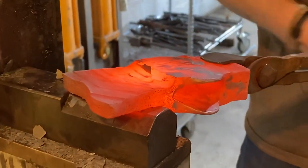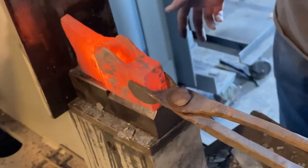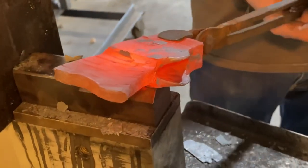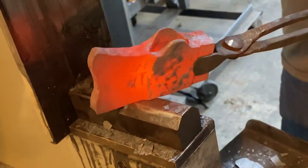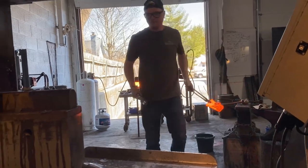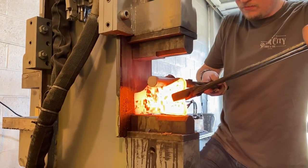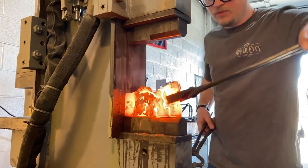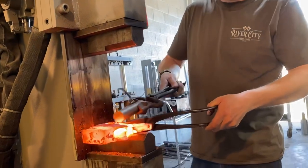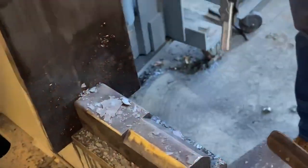Now that we've got those three fullers set, on our next heat, we'll come out and we will set the axe on the dies like this, and we will set our fuller down here. And that'll correct the bit of the fan out on the top that we've gotten, and it'll keep our flat. So beautiful. And then we'll keep drawing it out. Spreading the axe blade and drawing it out. It just cleans that up a lot. Awesome. Very cool. And I think we have enough meat now.